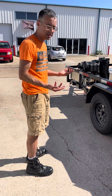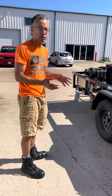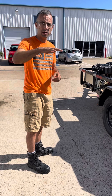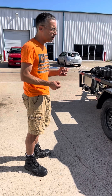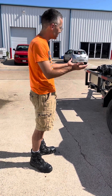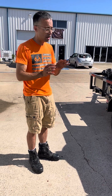For people going to South Texas, West Texas, and Louisiana, you'll have very poor road systems out there that have been neglected, especially in the oil patch. It's important to make sure you're not getting a cheap trailer, but a good trailer that will actually allow your equipment to last. This equipment can take impact from bumping on the road, so it's important to have the right axles and the right suspension. Also, when shopping for a trailer, don't get 7,000 pound axles if you don't need it. If you travel empty and it's only carrying 3,000 pounds regularly, every time you hit a speed bump your equipment is taking the impact — and it will void the warranty on your equipment, not just with us but with any manufacturer of this type of equipment.